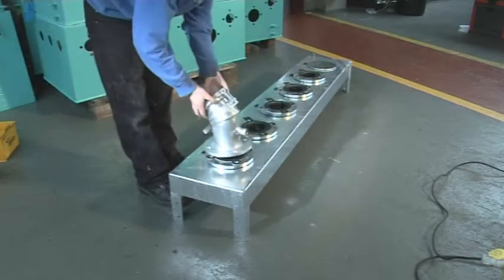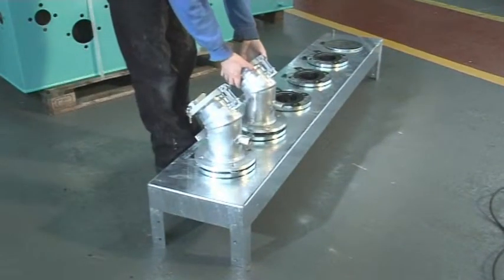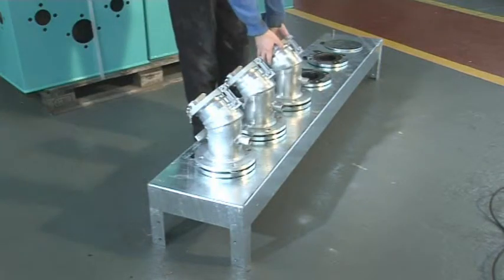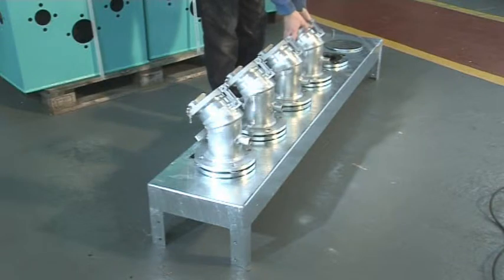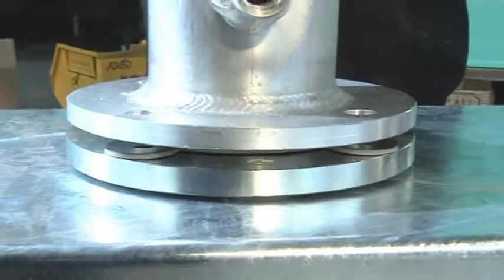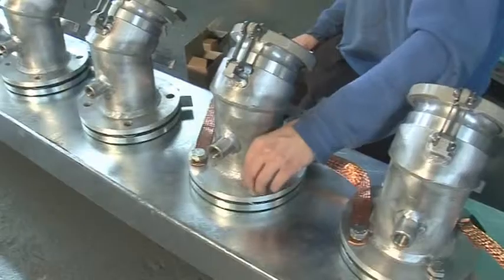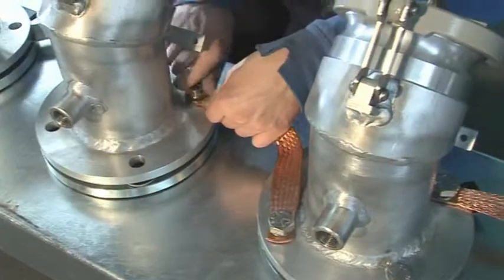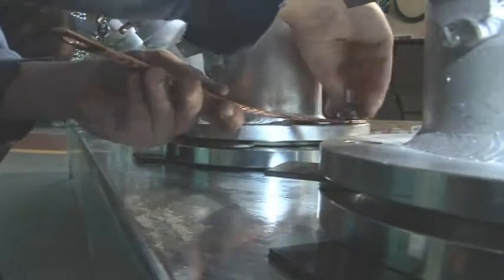The aluminium offset fill modules are then positioned in a manner to reflect the site specific layout. Earthing straps are then fixed to each module and grounded to a hook-up position on the tray to ensure earthing continuity across all components.